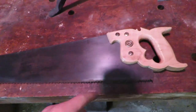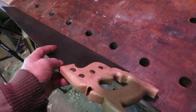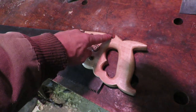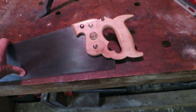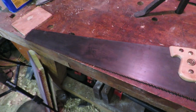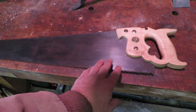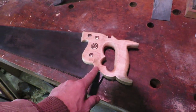After getting all the holes drilled, I went ahead and put four coats of shellac on the handle, installed all the hardware, and the handle looks fantastic. It is burnt right there in that little spot — I didn't want to keep sanding and wear away that little piece. But the handle turned out really nice. It looks great on the saw, and now we have a saw that once was all broken apart and completely rusted. The saw blade was cleaned up and re-blued so it's not too shiny, and it really offsets with the handle.